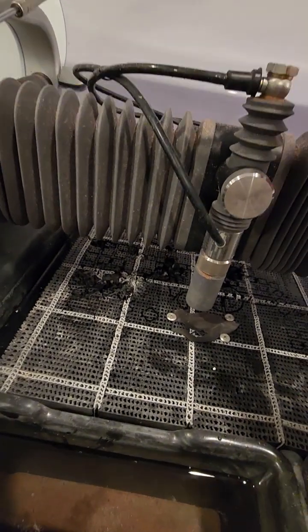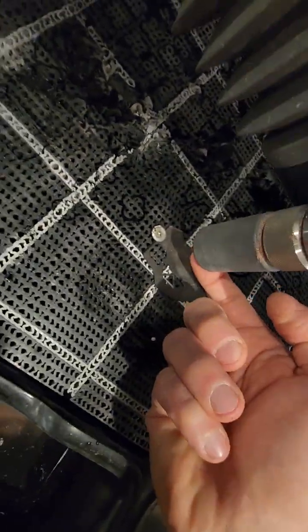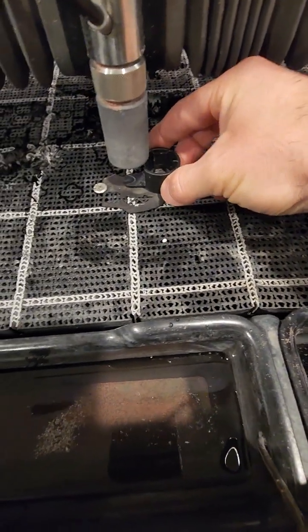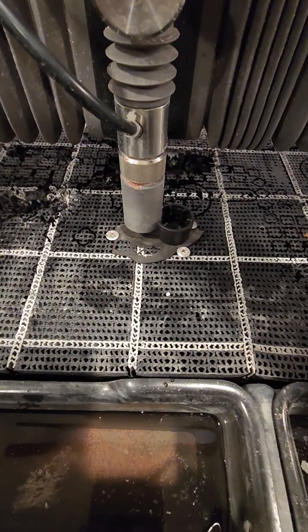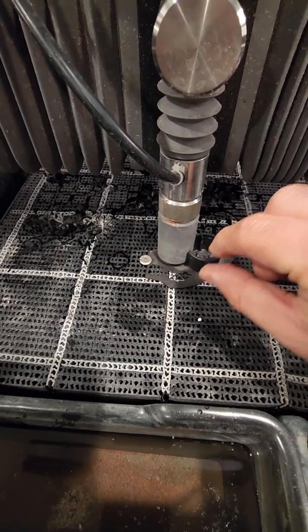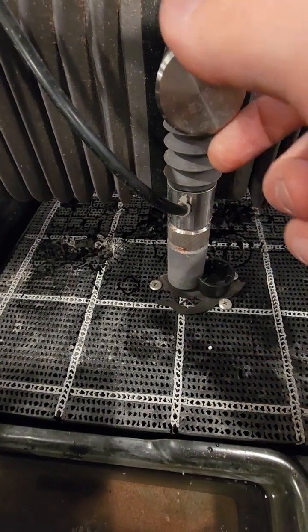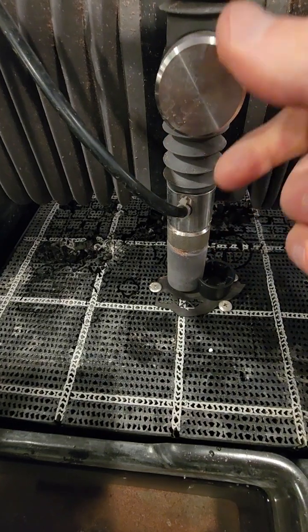Well, first things first, I always put my finger and clean. That's the head part. There is the head where the water and the sand come out for the cutting. So you make it loose, and then they give you a plastic piece which you put like this, and you bring it all the way down so your head will touch. This is the space, technically, from your work material to the head. And then you make it tight.